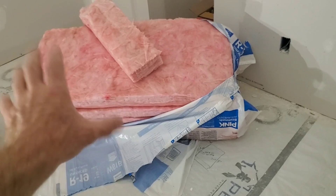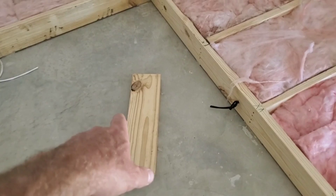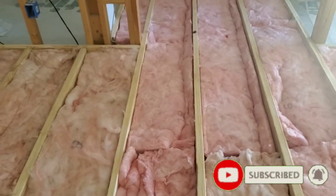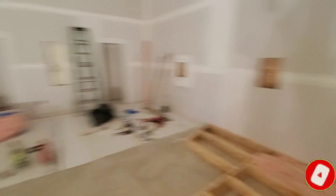One more thing — the second bundle of R19 I opened was two feet wide, but everything over here is on 16-inch centers, so I had to cut it. If you don't know how: you can take a two-by-four, overhang the insulation on it, and use a razor knife — the board compresses it and you can cut it super easily. That's what I used to cut the two-foot width down to fit my joist bays. Next up I'm going to start on the corners for the mains, some little corner pieces to hide wiring, and then the ceiling feature goes in. I'll have an update on that in a few days.